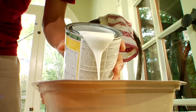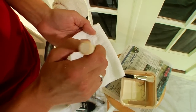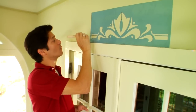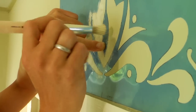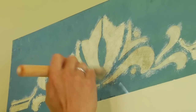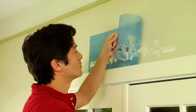You're finally ready to paint. Dip a flat tip stencil brush into the paint, and dab the ends of the bristles on a lint-free cloth or a paper towel, leaving the brush nearly dry. Using a dabbing motion and a light touch, stipple paint onto the open areas of the stencil. Don't add paint at the very end of the stencil where your pattern continues, to avoid creating a visible overpainted seam. Keep painting until the pattern is filled in, but the wall color underneath still shows through. When you're done, pull up one corner of the stencil and carefully peel it away from the wall.